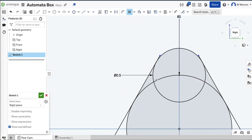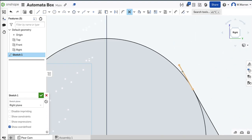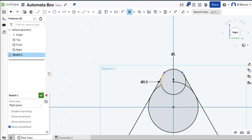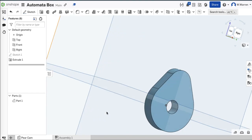I'm going to bring out my trim tool, zoom in so I can see, especially with little guys like that. Clean this up, get rid of extra geometry I don't need. I'm working towards a pear cam. I'm going to draw a circle in the center, make it 0.27 inches because our physical rods are 0.25. And I'm going to extrude the whole thing by a quarter of an inch. There — got a pear cam.